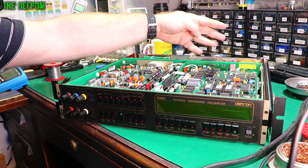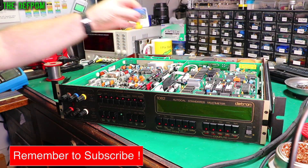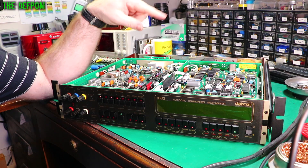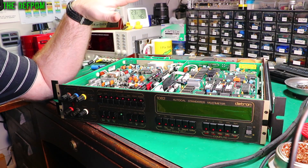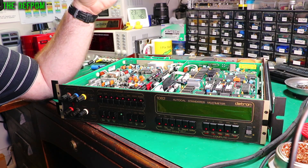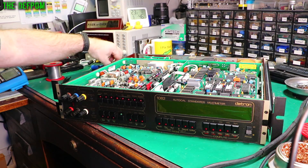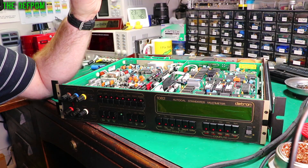There are a couple of tantalums on here — actually three tantalums on the back board on the power supply — along with the big electrolytic caps. The 15-volt rails have 25-volt tantalums on them, and there's also a 5-volt rail which has a 6.3-volt tantalum, which isn't enough headroom. So on 15-volt rails, 25 volts is pushing it. I'm going to go to 35-volt caps — more than twice the supply rail — just to swap those 25-volt tantalums out with 35-volt ones, just in case.